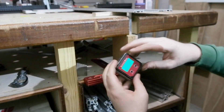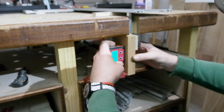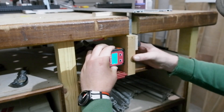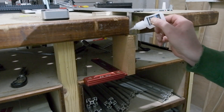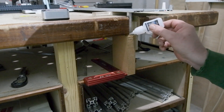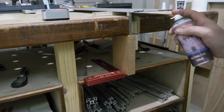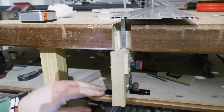Guide rail down and squared again — same drill as before with the level box. This time though it's not only checked for 90 degrees to the bench top but kept square to it as well — square as in line with the guide rail. Any bad alignment here will throw you out at different heights. Position and alignment triple checked, I dab on some super glue in a few spots to hold it in place, then get a bunch of steel brackets on — two each top and bottom.